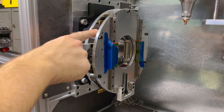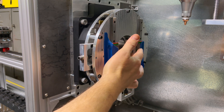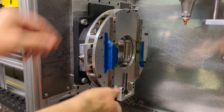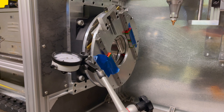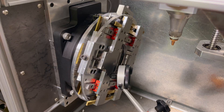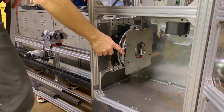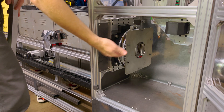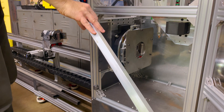After making those adjustments, I started out with 1.5 millimeters deviation between the two rollers and now it's down to 0.1 — that's a major improvement. I'm going to get this plate back on and centered to the best of my ability. After the adjustments I'm within 0.1 millimeters deviation on the Z-axis and it looks spot on on the X-axis. Let's get some square aluminum tube in here and take some measurements.